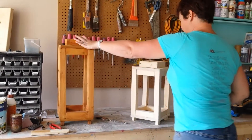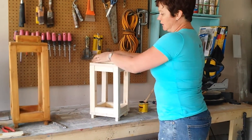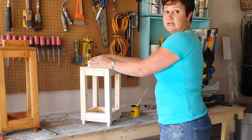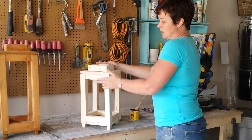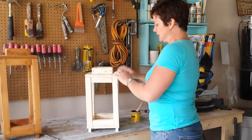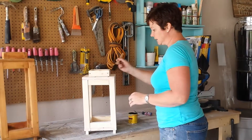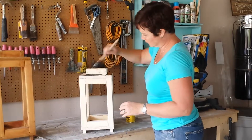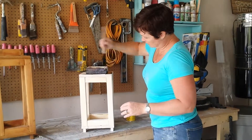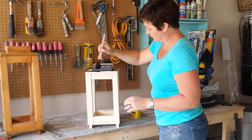For my second one, because I'm not so keen on that orange color, I'm going to go with a dark stain. If you used cedar two-by-twos and one-by-fours, you wouldn't have to stain it at all — just put it on your porch and nature will weather it naturally. But because I used pine, it does need some kind of protection, so I'm just using a dark walnut here. Don't worry that it goes on dark, because you are going to wipe some of it off.